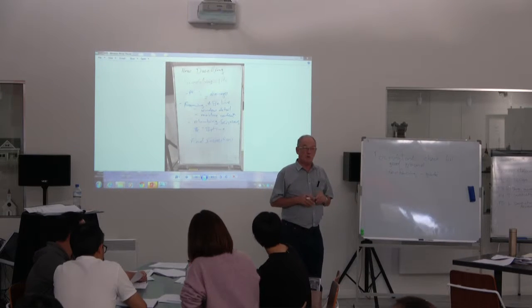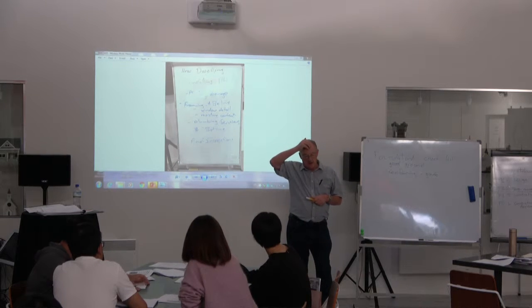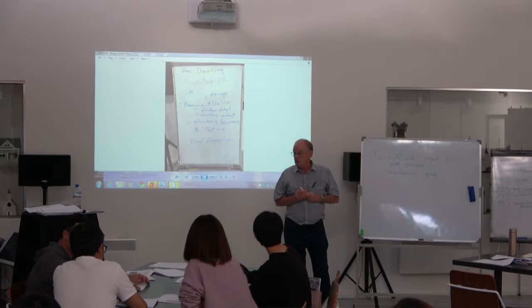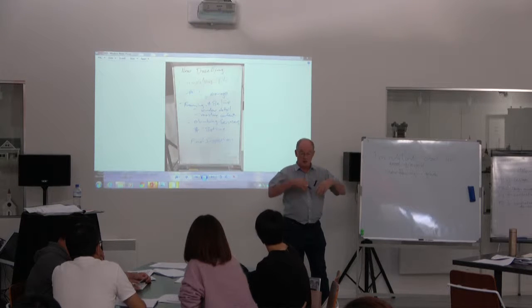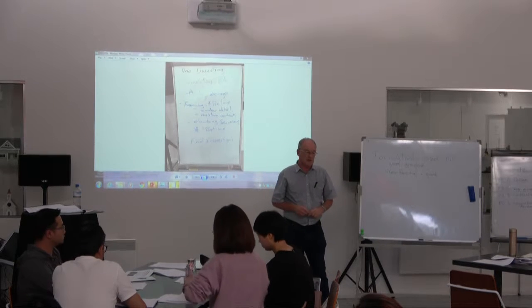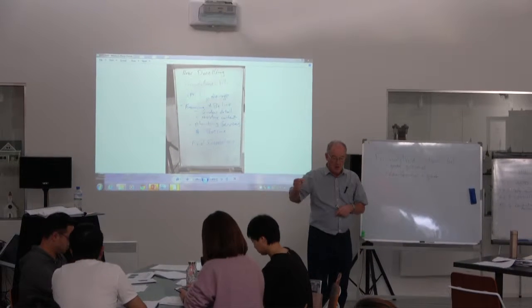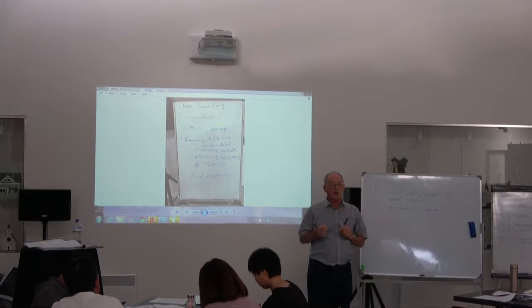I've been onto jobs where I've walked in, and there was a classic one, it used to be on TV, and I was told by the council, go and do this inspection on this house. So I walked onto this site, and the guy, his name was Coxey, passed away just recently, I think. He was doing this house, and it was all going on TV, showing everybody how to build. I walked on site, and as I walked past the foundations, which were already poured, I just shook the foundation bars which were standing up, and I knew straight away they were mild steel.